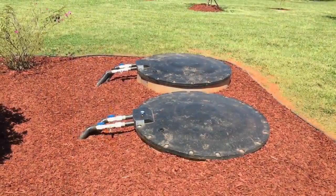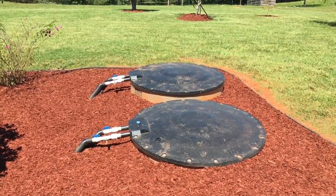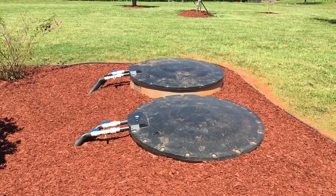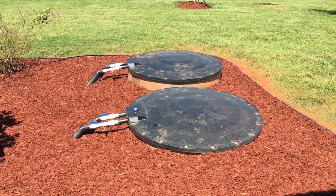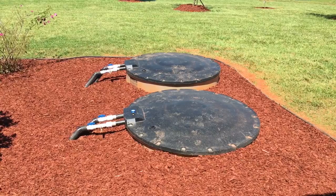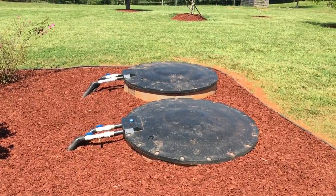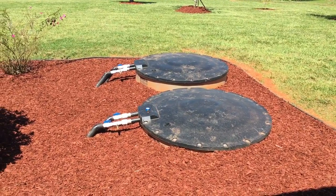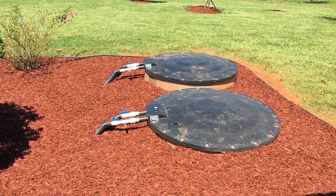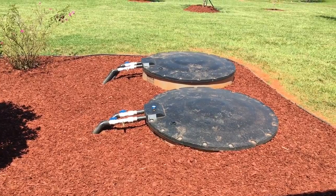These are the chillers. Those big white chillers are doing a lot for this house — they're making all the hot water and pulling heat out of the air inside. This is summertime operation: they pull heat from the house air and focus it into the hot water heater. When the hot water heaters are satisfied, they switch over. He's able to run the chillers full bore when the sun's out, harvesting solar energy in the form of heat and cool so he doesn't have to store any electricity in a battery.